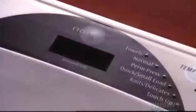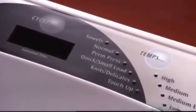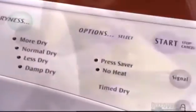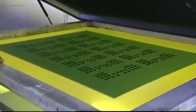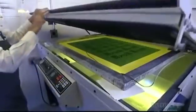The surface on the appliance's control panel is called the graphic overlay. It's a sheet of plastic on which they print the design of the control buttons. Each button has a membrane switch underneath it. To make this graphic overlay, they first laser print a sheet of acetate film with the design, as many copies as will fit. They lay the film on a polyester screen coated with a light-sensitive chemical.